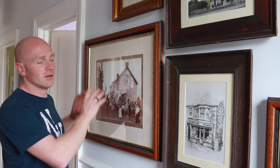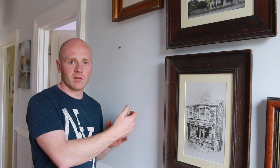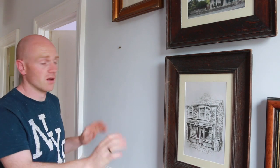Most of the walls are beginning to dry already, so now we've ended up with these really nice smooth walls right up to where they've capped off the top. Believe it or not, we're over a year and a half on from when I originally filmed that video and just never put it out. But this is the wall where you saw me doing that patch — having the daylight coming in means you should be able to pick up any imperfections. We had the whole wall skimmed, so I wanted to get it within a millimetre or so flat with the rest of the wall, and it was scrim-taped, so when it was all skimmed over we had a seamless flat surface.